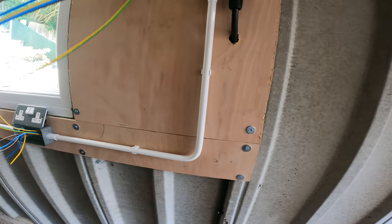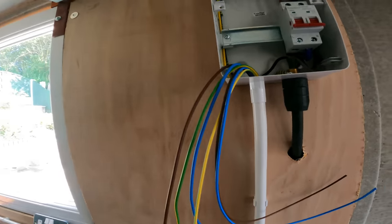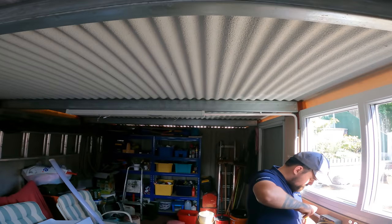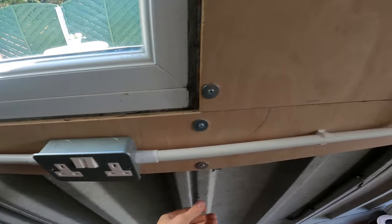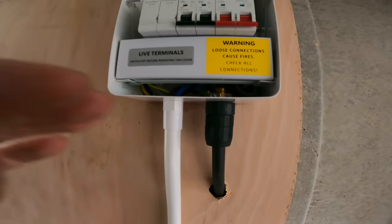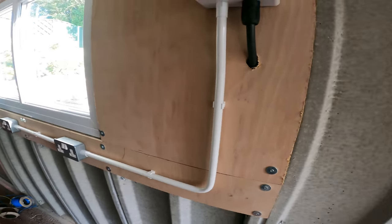A little bend there with a set into the board. Pretty straightforward, to be honest. Conduit down, switch, socket, socket. Beautiful bend, beautiful set, beautiful arm coming out the back of there. Straight in there. That's that done. We just need to go and do the other end, and then we can do some testing in here.